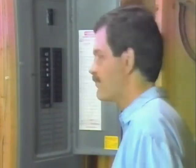On the inside of the service panel door is the index telling you what areas are controlled by each existing branch circuit. If your panel isn't indexed, do it now. You can't plan your new wiring if you don't know what your existing wiring does.